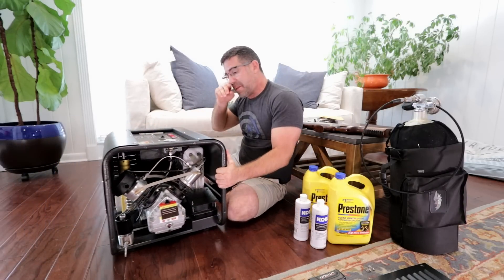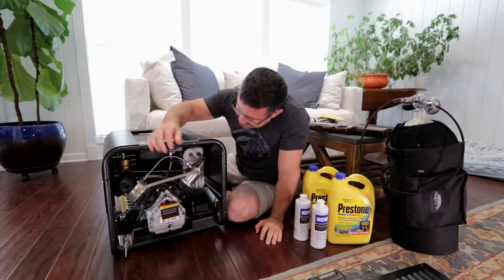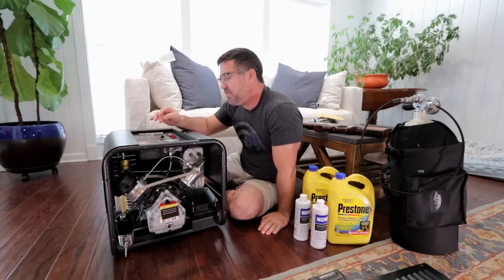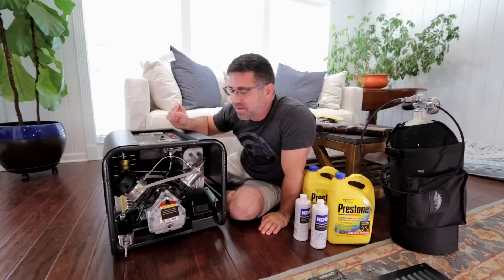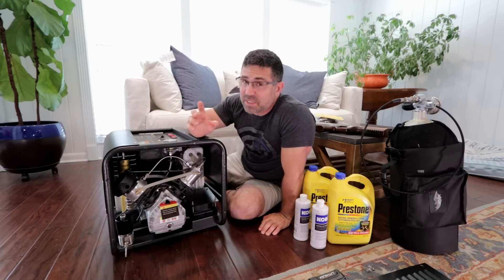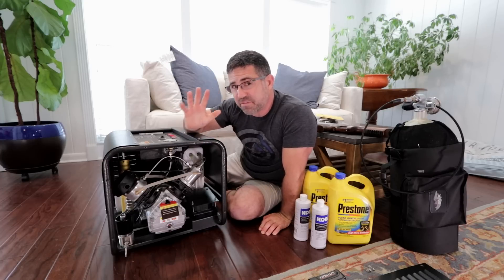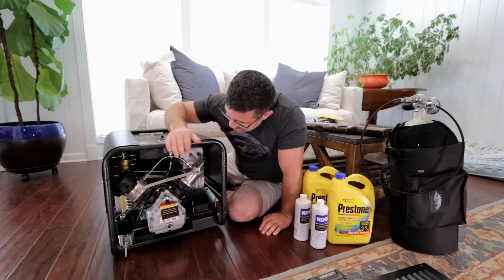This is the twin piston system — as you can see, it's liquid cooled. Here's the line that runs from cylinder head to cylinder head. The temperature gauge up here keeps an eye on that. The owner's manual says you never want to exceed 195 degrees Fahrenheit. And the owner's manual itself is really, really good — it's the best owner's manual I've seen for a compressor yet, and this is the fifth compressor I've reviewed in about a year and a half.